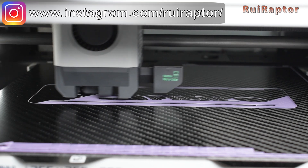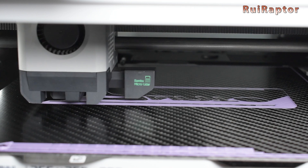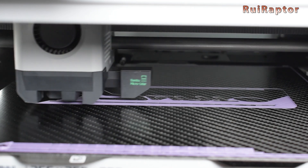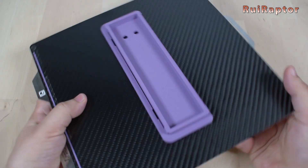Printing with PLA filaments shows no issues whatsoever. The plate was set at 65 degrees C and the filament sticks very well. With the plate cold, the printed parts come out easily.